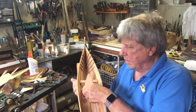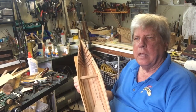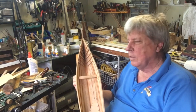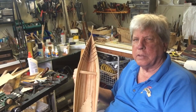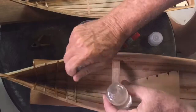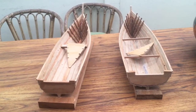Having put the termite fluid on, it's not just good enough to leave it there. You should really seal it in so it doesn't rub off, and it keeps the treatment in the wood, which is where you really want it to be. So I will seal the inside — I'm going to use rub-on poly, which I'm going to paint on. But the truth is any paint would seal it in. It smells very strong, so you tend to want to put it outside and let it dry off before you seal.